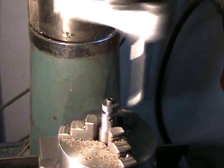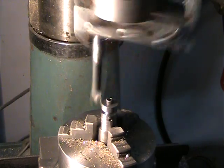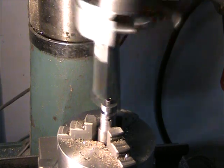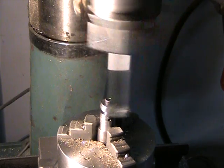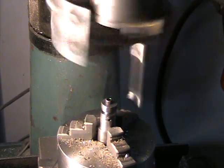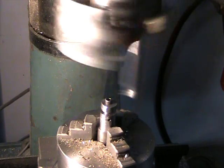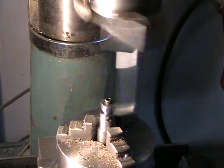Cranking in ten thousandths and trying again, going very slow. Going in another ten thousandths — actually I'm going twenty thousandths on each pass. I'll drop back to ten thousandths so I don't knock that loose. You can see it slowly cutting that side away in a curved profile.